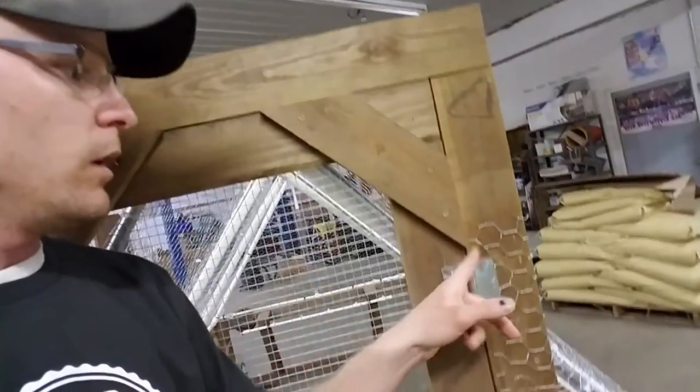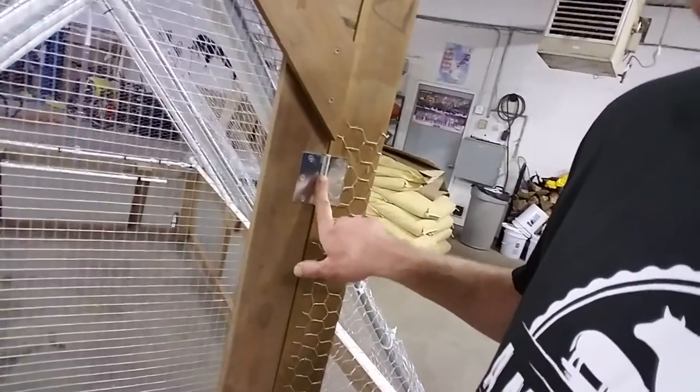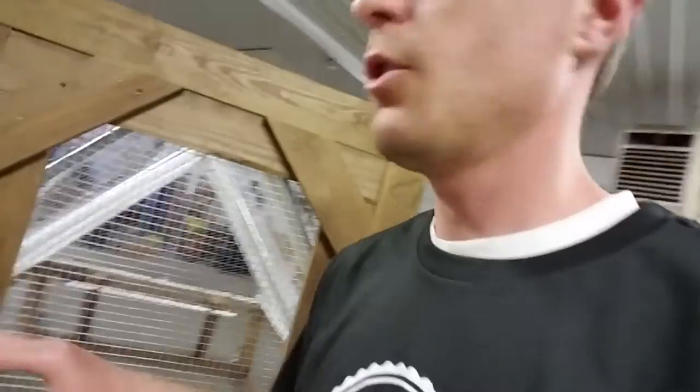You need to make sure there's plenty of space between the door and the frame. Right now there's only about an eighth inch on each side because this is treated wood that's swollen — it was actually frozen when I bought it and as it dries it's going to shrink. If you put about an eighth inch on the sides, by the time it all shrinks down — I can fit my whole pinky in last year's tractor, so it's close to a half inch. That means you may have to take your locks and hinges off and move them. Always do the door last.